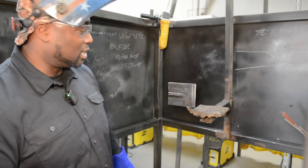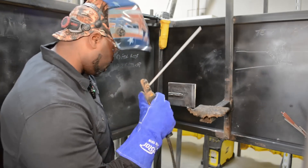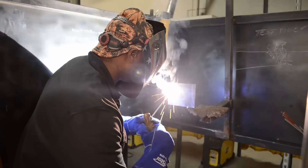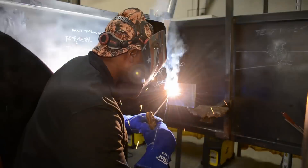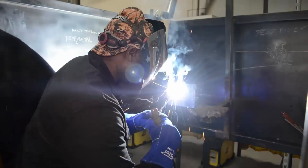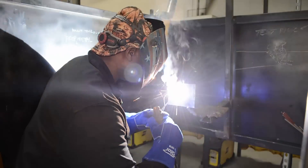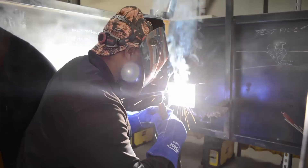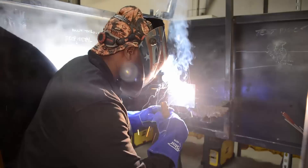As you see, we're putting our rod in at an angle for the horizontal position so gravity does not pull it down. Watch your eyes. See how we're just slightly going up? Real tight — standing in our puddle, keeping it real tight. Real slight movement up, real nice tight slight movement up with the stringer. Standing in our puddle the entire time.